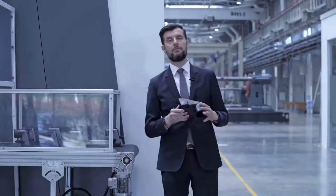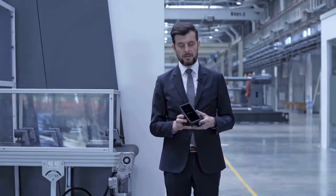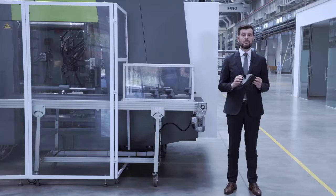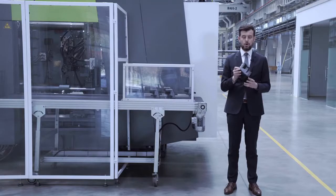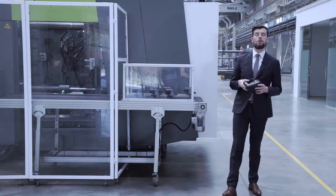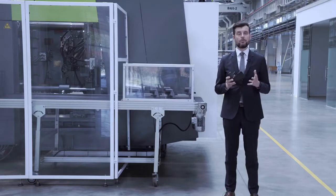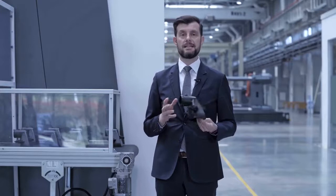It's an air duct for an air filter housing of an internal combustion engine. The material used is PA66 with 30% glass fiber reinforcement. You have two cores and two hot runners in this two-cavity mold from our mold maker. The shot weight is around 450 grams and we produce this part in a 42-second cycle time.